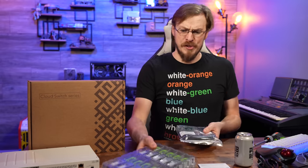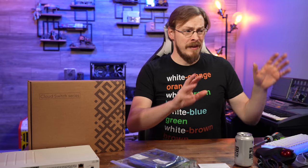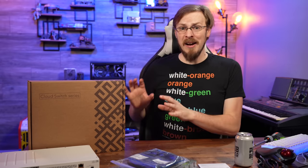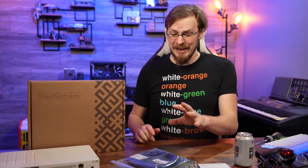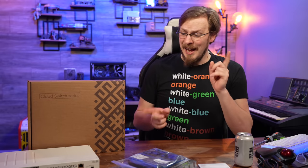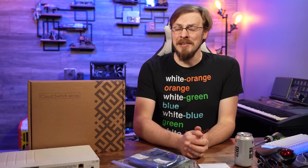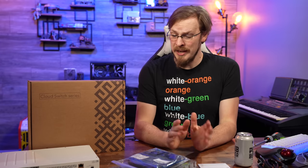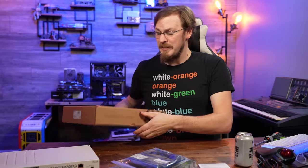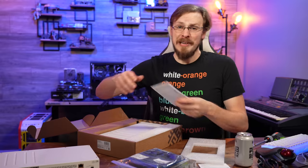So what's the first step in all of this? Well, rather than running my network cable and then hoping everything works on both ends, I think I'm actually going to unbox both switches right here, connect my optics and my single mode fiber between them, and make sure I get lights. So that's gonna be step one before I waste a lot of time and energy in putting something together that's not going to work. So let's get the second switch out of the box and let's light this thing up like a Christmas tree.